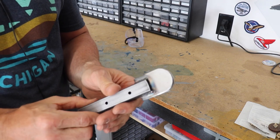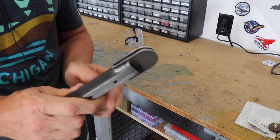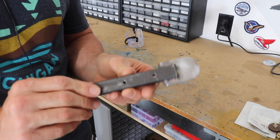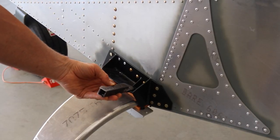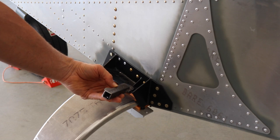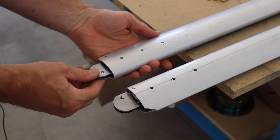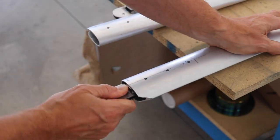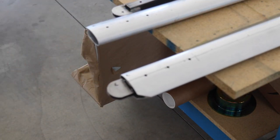Here's what it looks like finished — all nice and smooth and ready to install back into the strut. I think before I put it in the strut I'll finish sanding off the black on here and get a coat of primer on these. You can see how they go on, just like that — measure for the hole, drill it, and it's ready to go. This one here I can push right in, put the bolts in, and it's ready to go, but this other one is really really tight and I can't pull it out — I'll show you an easy way to get that out.